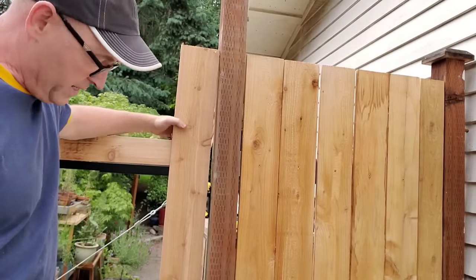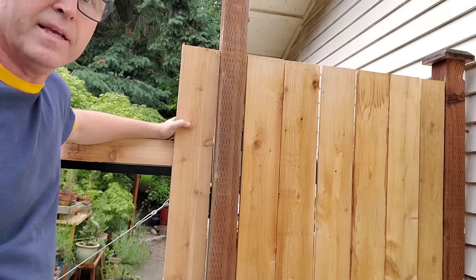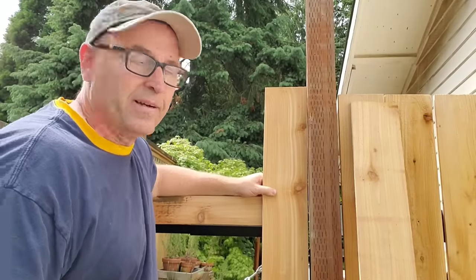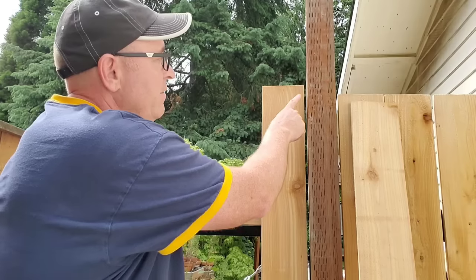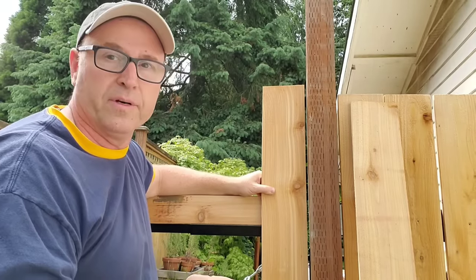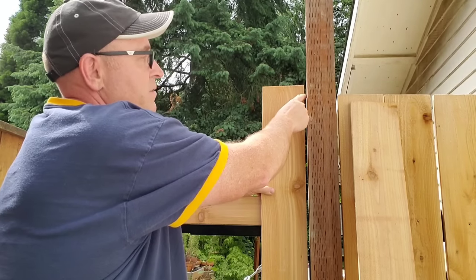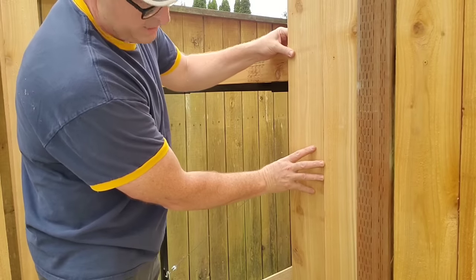This board is sitting on the ground, so I'll need to trim it — probably about an inch off — because it opens on the inside and I've got cement on the other side so there's no wiggle room. Actually, I'm changing my mind. I'm going to lift it up about an inch and a half and put a subtle arc on the bottom just to see how that looks. Worst case I can remove the boards and cut it straight. I'll just start lining up the top and figure out what the arch looks like.